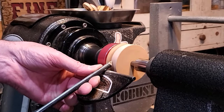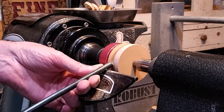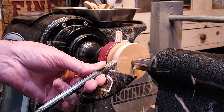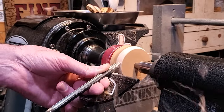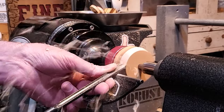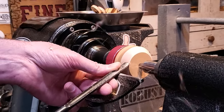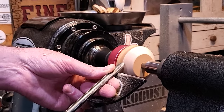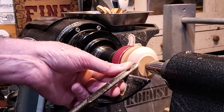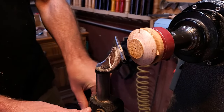What you want to do for a fridge magnet is put a little relief on the back side so that you can grab it off the fridge without having to slide it across, depending on what kind of magnet you use. Just make a little relief on the back side, then go ahead and clean up the front. This one I just domed over — it's a beautiful piece of maple burl so it's going to stand on its own; you don't really even need to decorate it.